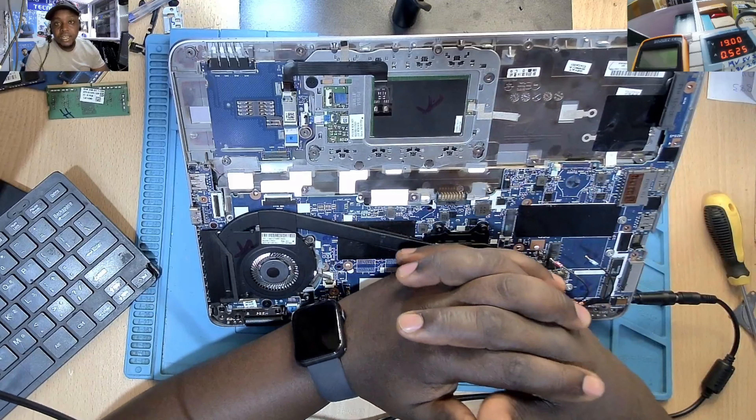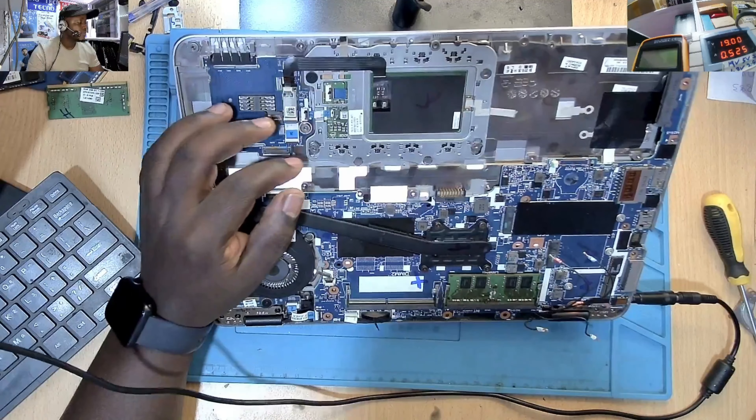It's not in all cases that a corrupted BIOS will result in a motherboard that is spinning the fan. Some motherboards will not spin the fan at all — just quiet: plug in the charger, nothing is happening, maybe drawing two to three milliamps. You can still program this chip and the machine is back to normal. Know when to determine if it's the BIOS or if the motherboard has other issues. Most of the time when you have 19 volts, 3 volts, 5 volts, and sometimes 1.8 volts near the RAM, and 3 volts on the BIOS chip, most of the time that machine has a corrupted BIOS or the BIOS chip is not working. Program the BIOS and the machine will be back to life. Guys, thank you so much. If you haven't subscribed, please support our channel. Let me know what you think in the comment section — on to the next video, bye!